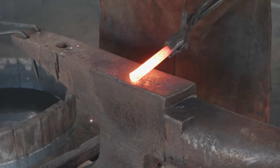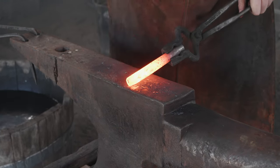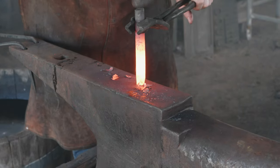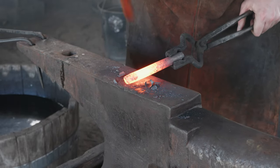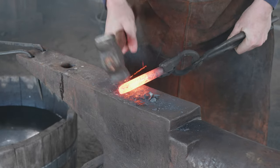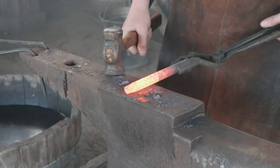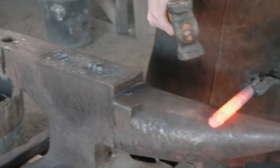So we're going to come in and just make a lazy octagon here in the back. Let's keep this all nice and flat. Once we've got our struck end ready, we'll come in and file a chamfer on those. We're going to come over here to the horn.